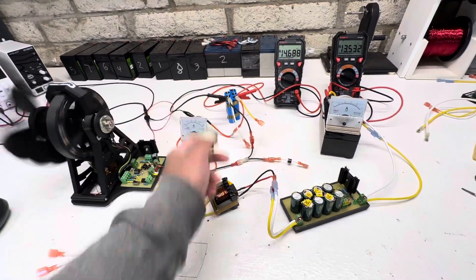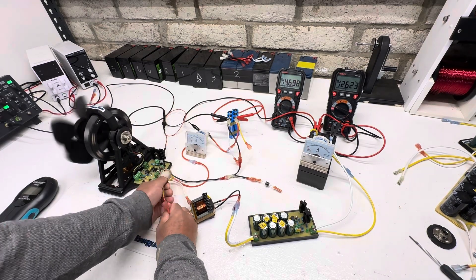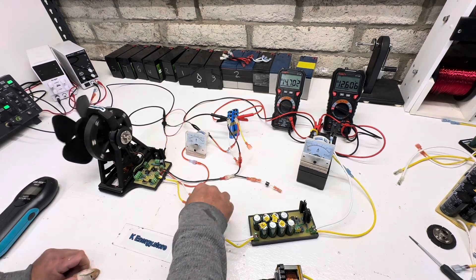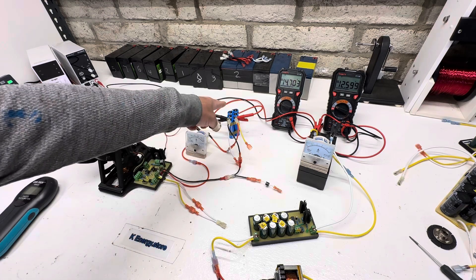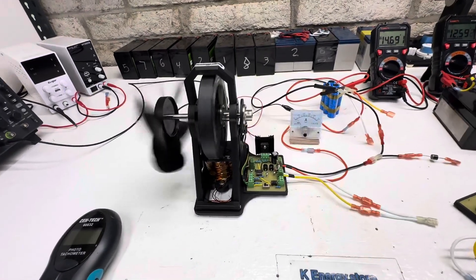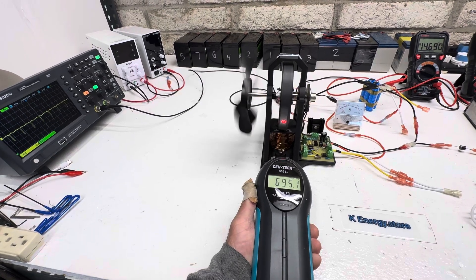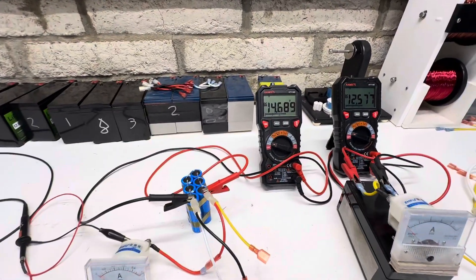The last output mode for this motor is to short it back to itself. In pretty much all pulse motors, doing this creates a direct short and really hurts them — but for some reason this motor likes it. The output comes out and goes back to the positive that way. Normally that's pretty detrimental, but on this motor it actually works well. Now we're using just 60 milliamps, and the RPM is 694 — almost 700. Pretty interesting little effect.